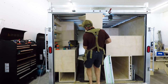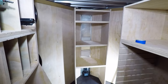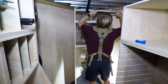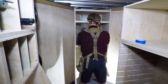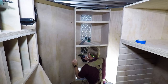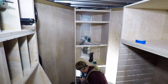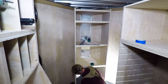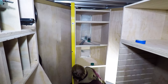It's pretty floppy in the meantime because there are no cross members other than the shelves. I just centered it up, took a square to check I was pretty close, and then used a countersink drill bit — Fuller brand, which I've been using for about 30 years. I have a kit and just buy new bits and parts, probably replacing the whole kit three or four times over the years. Great stuff. I screwed back into the three-quarter inch ultralight ply, which holds screws well, and used a level straight edge to push the outside out straight and put pocket screws into the floor.